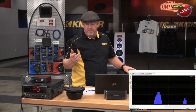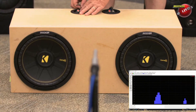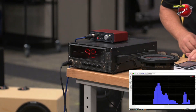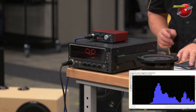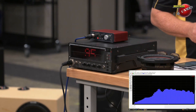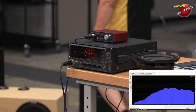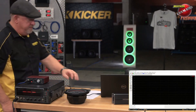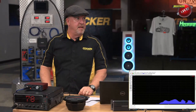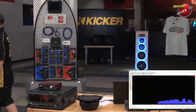That was with a tone. Let's do it with pink noise. Let's put it back in phase — we should be back at about 98 dB, and there we are. Now switching to pink noise: we're at 95 dB with them playing in polarity. Now out of polarity with pink noise: 78 dB.